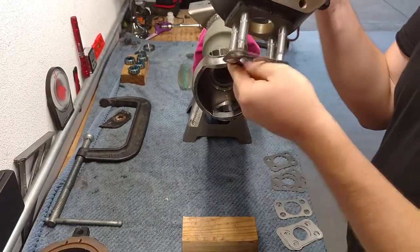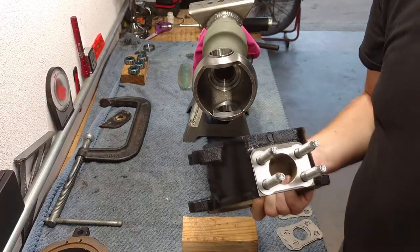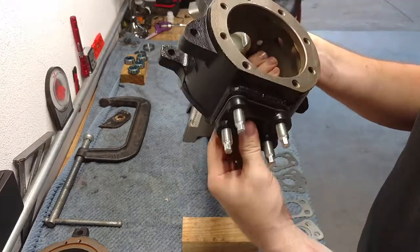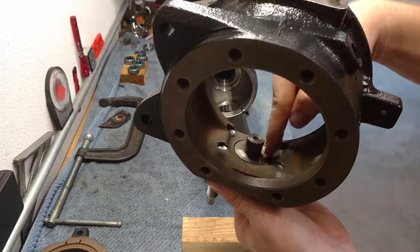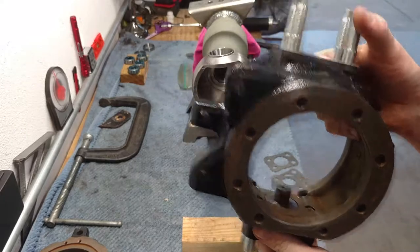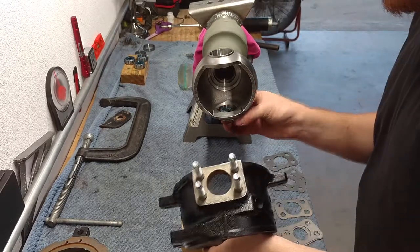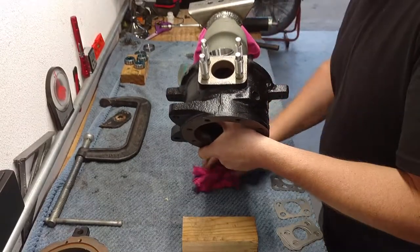We're going to take one of our large shims and put it in. Take your bearing cap and slide it over, getting started poking up through there. This is all a pressed seal — you don't need any seals or anything in there. That collar passing through will seal to this; it doesn't get any leaks that way. Take one of your bearings and place it up in there, setting it to kind of hold the bearing in place temporarily.